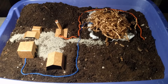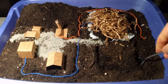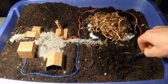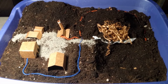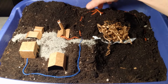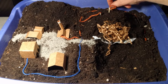As our cell fills up we're going to do two things: start getting the next cell ready to expand into, and start closing the parts of the old cell that have been filled up to the permitted elevations. In our closed portion, I'm going to show you vertical landfill gas wells. We can drill a well down into the waste, then connect the well to the header with a lateral pipe to extract gas from that location. We'll space our wells throughout the mound so that we're getting good coverage throughout the waste.